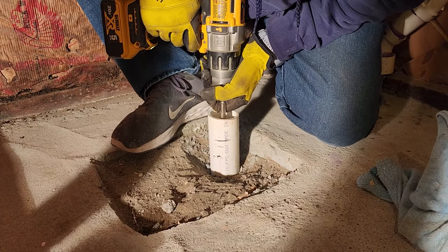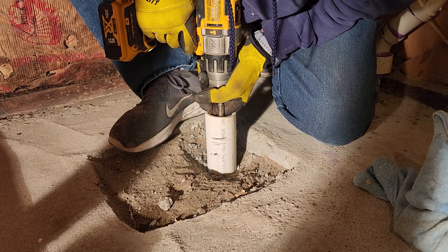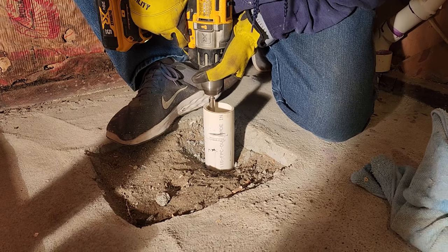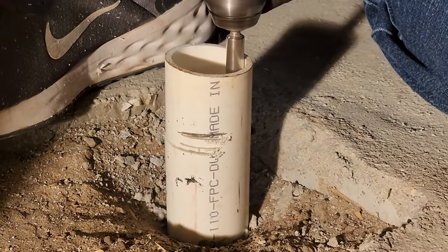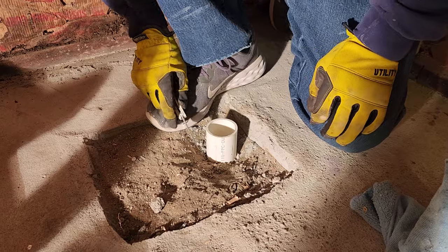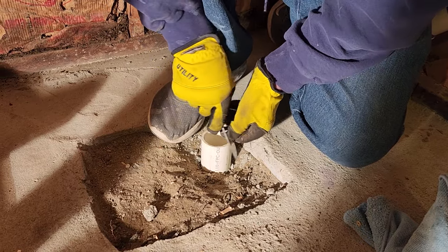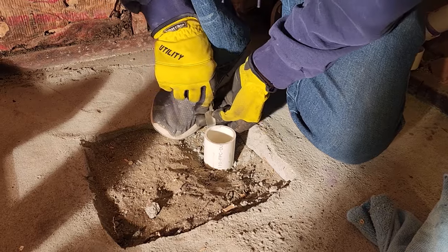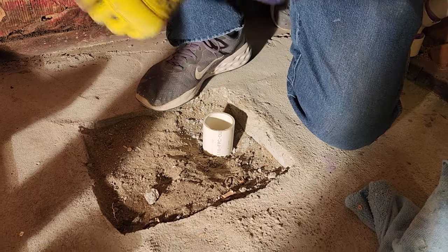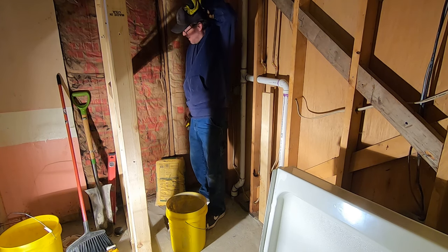At this point you could use a hand saw, a Sawzall, or anything to cut that piece of pipe. That brass shower strainer is sturdy and it'll actually slide over the top of the pipe — there's a rubber gasket we'll show you later. They do make glue-type shower strainers, but you've got to be exactly precise on your measurements and cuts, and if you're off even a little bit, it's a pain. Once you cut the pipe, deburr it with a pocket knife — you want all the shavings off and a nice smooth piece of pipe sticking up.